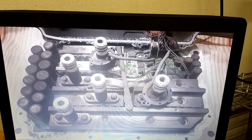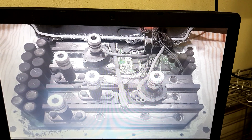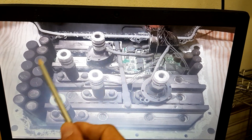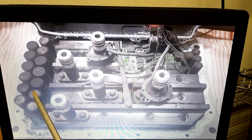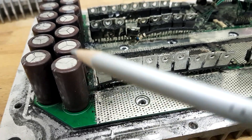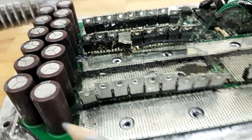If you've got such unipolar electrolytic capacitors with 100 volts, they're able to handle peaks of maybe 20% on top, but that's quite tight in my opinion. Overall, with 470 microfarads each, we end up with around 6 millifarads. That is sufficient, even though you could place bigger caps in here — so they're wasting a little space. Why not install caps with more height and maybe 680 or 1000 microfarads each?